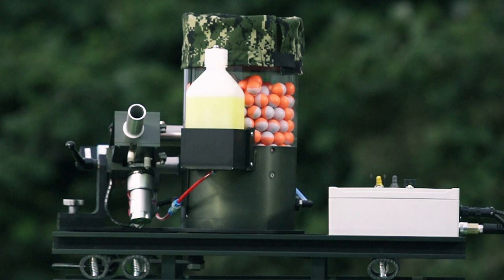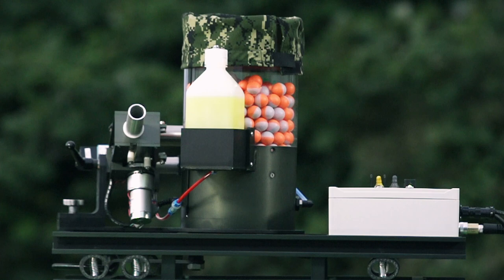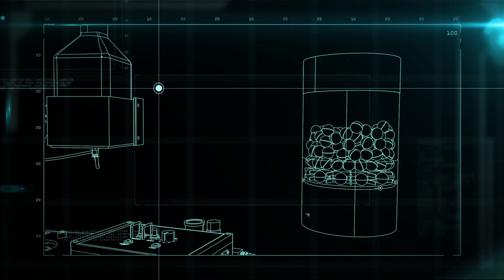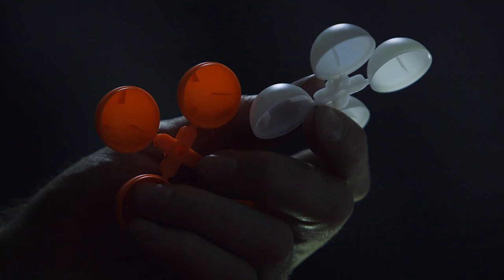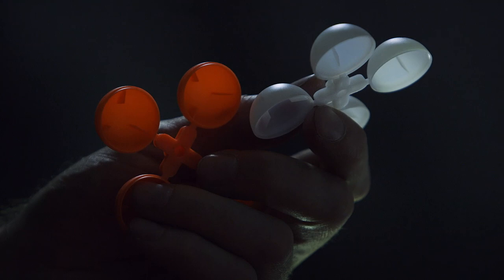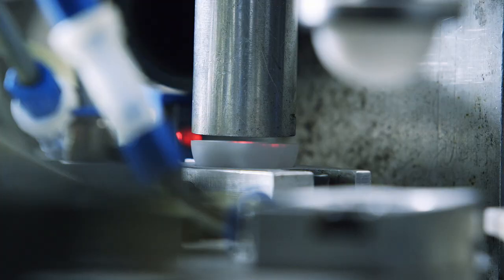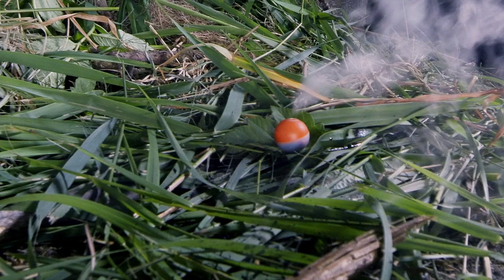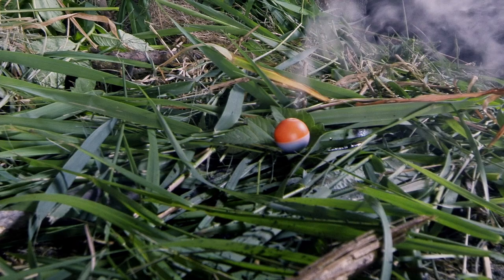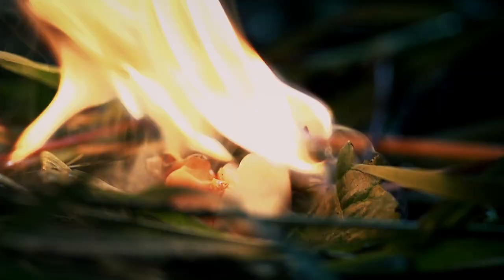The Green Dragon launcher is made up of three parts: the chemical injection system, the launcher, and the eggs. The incendiary eggs are made up of two halves of a plastic sphere that's three centimeters in diameter. The egg is fueled with crystals of potassium permanganate, a chemical that on its own is harmless, stable, and non-combustible — until you inject them with antifreeze, or glycol, which in 20 seconds results in a volatile exothermic reaction that flares at over 2,200 degrees Celsius, causing enough firepower to set even wet wooded areas aflame.